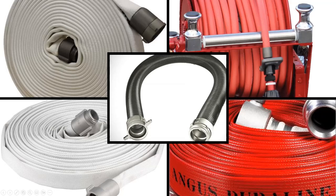This is an example of just rubber fire hose — quick connect couplings. These are used a lot for bumper trash lines on the front of an engine, because when you're fighting a fire in an alley there's glass, needles, or sharp bits of metal that would get stuck in a cotton jacket, whereas with rubber nothing's really going to stick in it when you drag it across the ground.